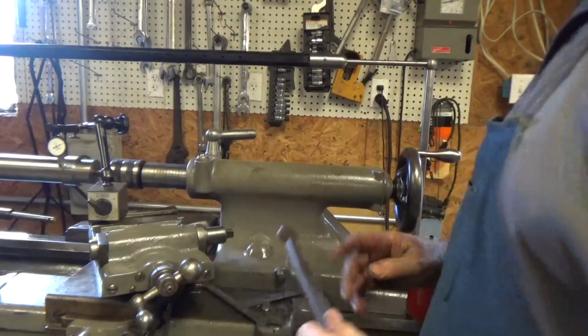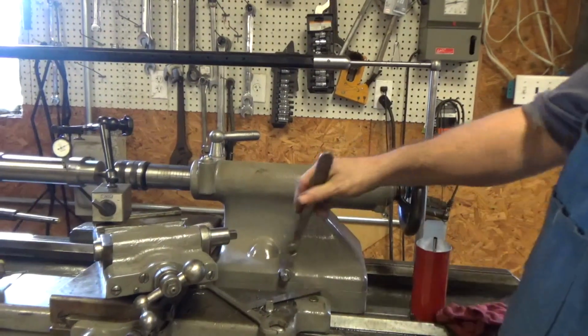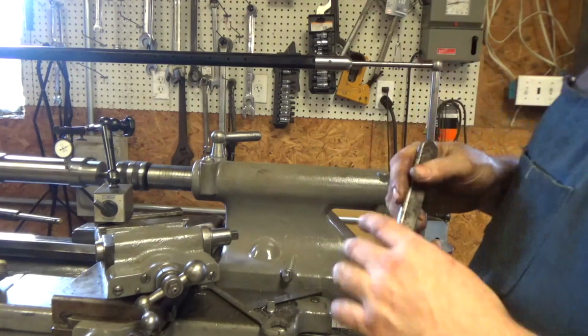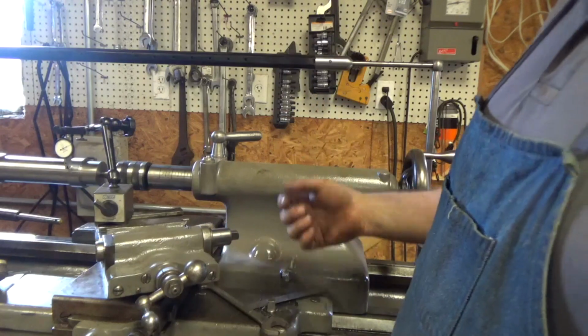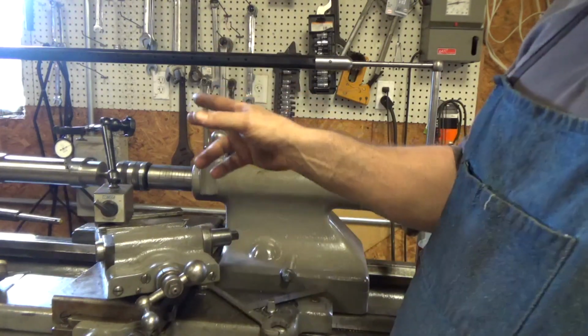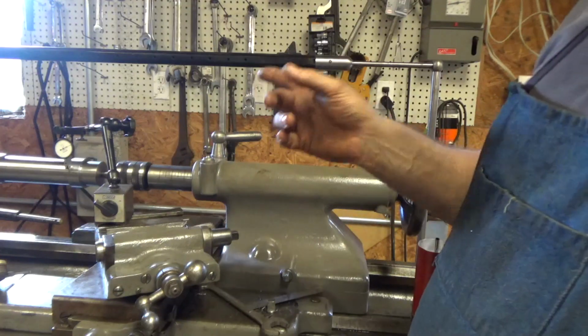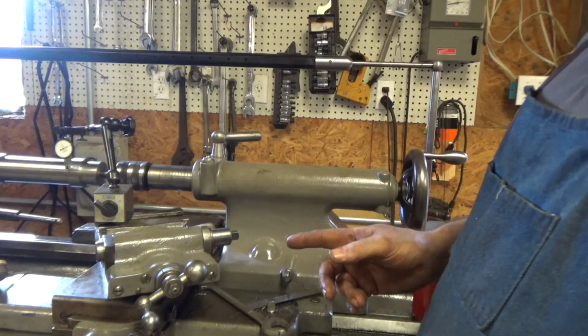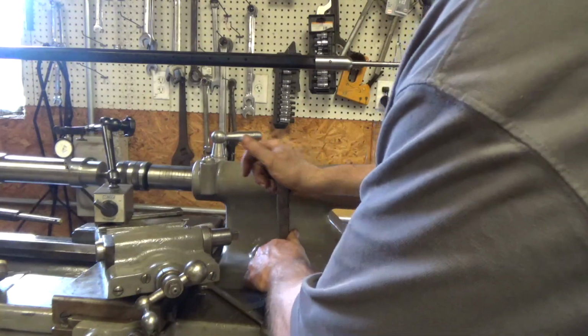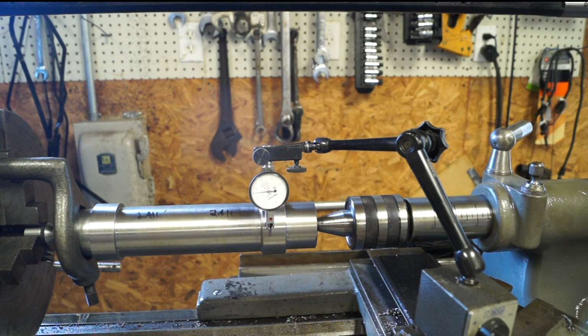The way we need to adjust this lathe, there's 2 bolts, one here and one on this back side. These things are jammed together, so we have to loosen one and bring it over. So we need to bring that over to 0, and so we're going to loosen this bolt. Look at that, it came over by itself. Look at how much spring was in that.